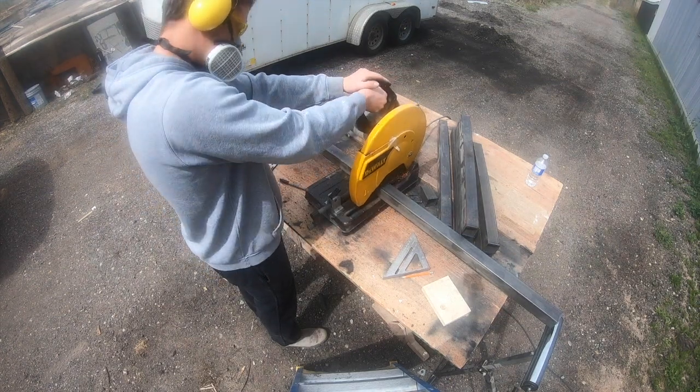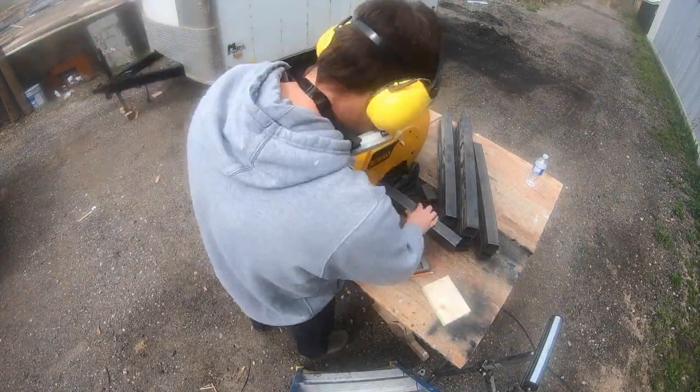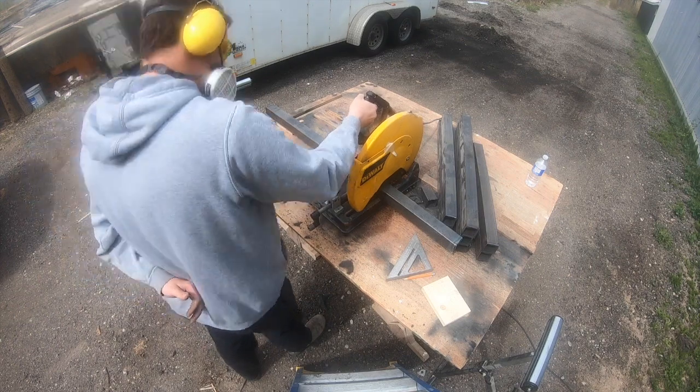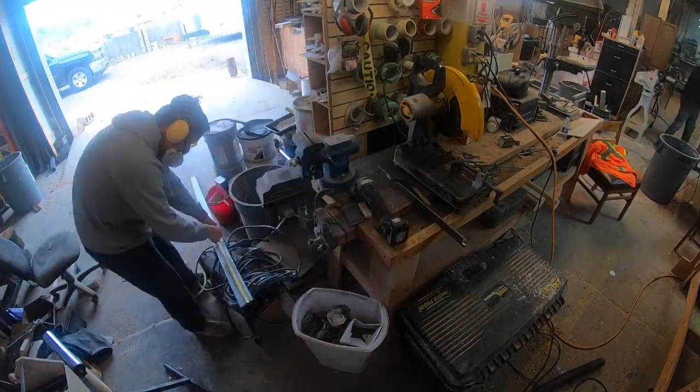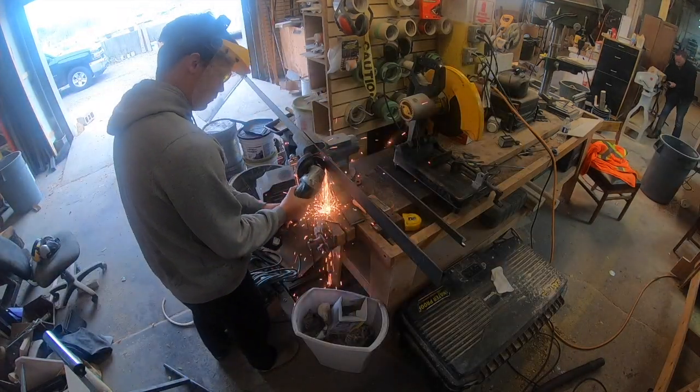Now by installing a welding table, that's actually going to be a solid steel table. So whatever piece we want to weld, we just place it on this table, which already has a grounding clamp attached to it, and it's going to allow the current from the welder to travel safely through the table back into the machine.